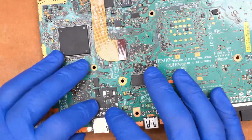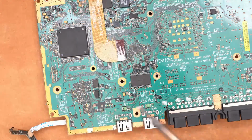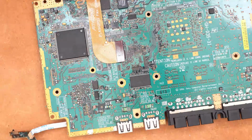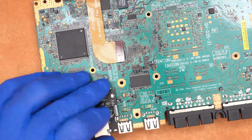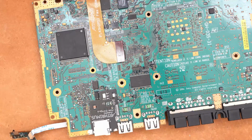So this power board is really designed to sit in this area, and it's designed to not have any components underneath it. So if you're going to install this on a V13, it may be a little bit tricky to get it to sit exactly the way it's supposed to. You might have to set it on top of the components and maybe use some double-sided tape, and that may interfere with being able to insert and remove the SD card through the grill, through the front vent of the PS2. Now, I am looking into a possible alternative power board design that would work with a V13 without any of these issues. So it's on the docket as something to look into, but no news yet.